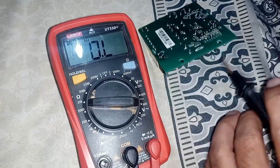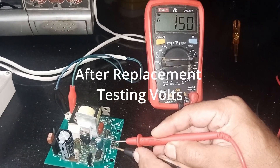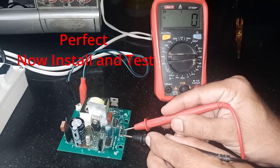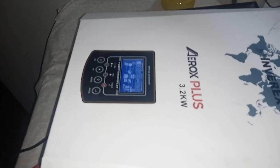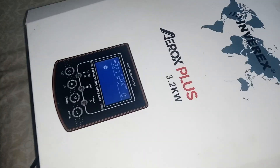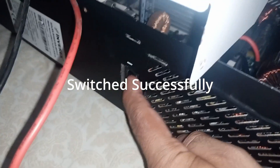Now, after replacing all the components, we are testing the output. We are getting 150 volts DC. Reverse polarity shows minus 150V DC, so this SMPS module has been repaired properly. Install it in the inverter and test it. Give it 220V AC supply and check if it turns on. The inverter turned on successfully from utility source only — neither battery nor solar supply was connected. Switch it on and test utility switching — the inverter has successfully switched to utility as well. That means our repair has been successful and the inverter started with utility too.